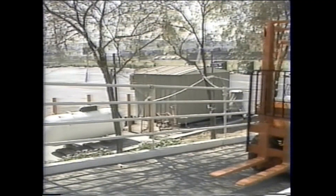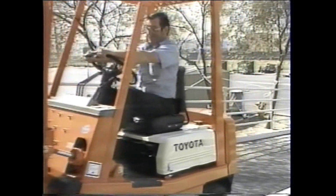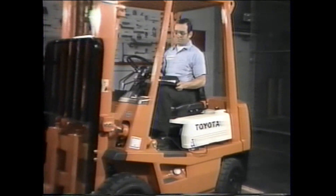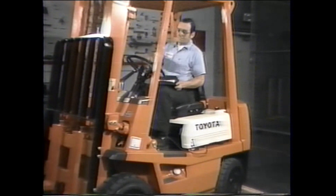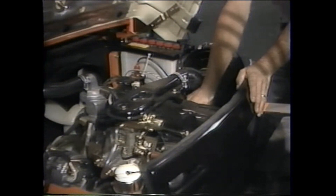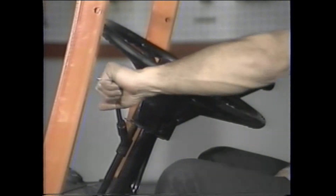In summary, if a truck is suffering from insufficient power, two stall tests must be conducted to isolate the problem area. The first is the engine stall test to find the no-load governed maximum speed, and the second is the engine stall test to find the maximum speed when loaded. If the problem is isolated in the engine, repairs can be made, but if the engine checks out, a transmission stall test must be conducted in both forward gear and in reverse.